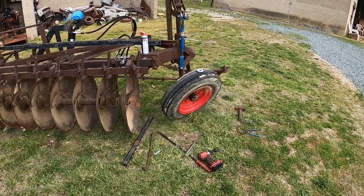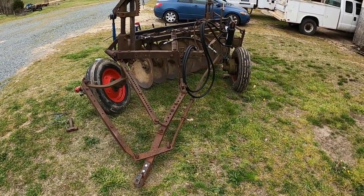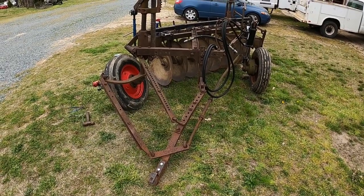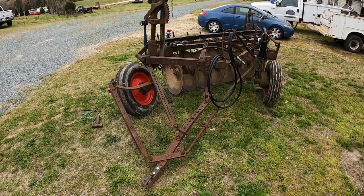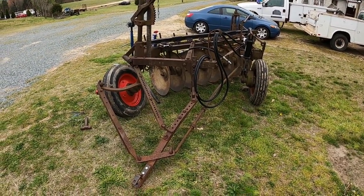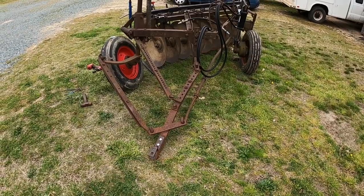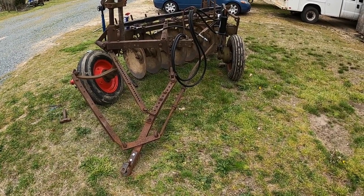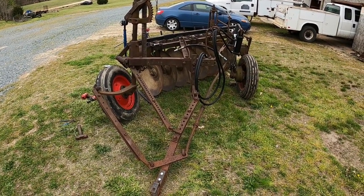Let me show you one last issue we've addressed here. Last but certainly not least is the hitch itself. The center line of the plow is about right here and you can see how far off the hitch is. I messed with that last year when I tried to put it in the dirt. But I really think we solved the disc leveling problem today. We've got to get this hitch back halfway right — I've got a lot of information on it and still need to do some more tinkering. This is going to go behind the 1086. I was going to pull it with the Oliver, but due to the fact I didn't get the clutch in, I'm not going to stress it out anymore. So we're just going to keep it with the big tractor.